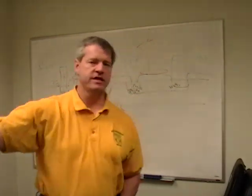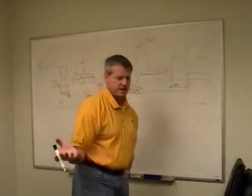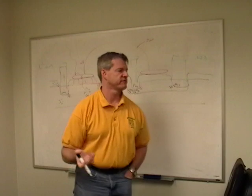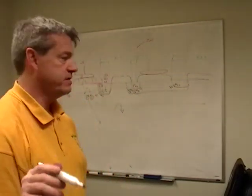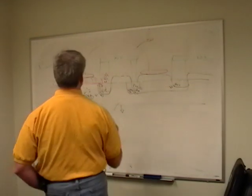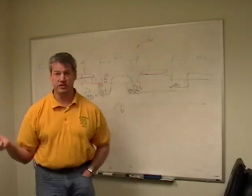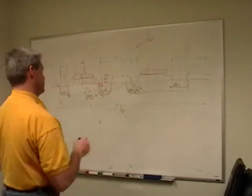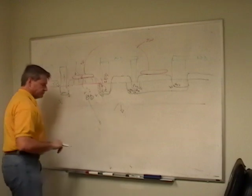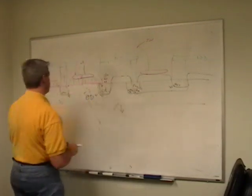And there's natural radiation around us all the time, right? We've got radioactive decay of just ceramic materials, in fact. The chips on old PCs used to be made out of ceramics, and this was some amount of a problem. It's one of the reasons why they had a parity chip in there in the old days, was to detect that you'd had a bit flip somewhere, because this is enough to flip a bit, because of the way memory's made, which I won't get into right this instant, but I might come back to.